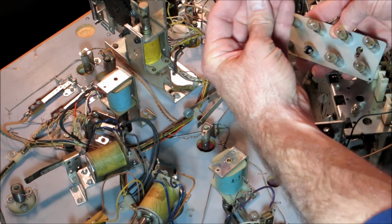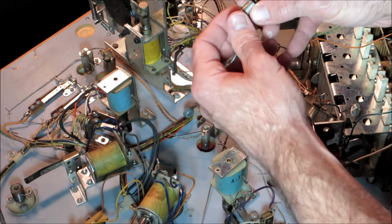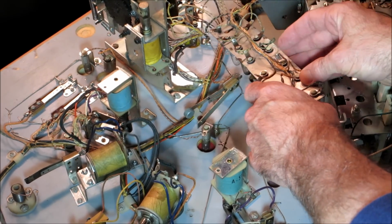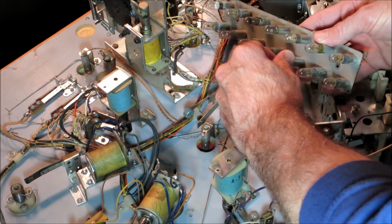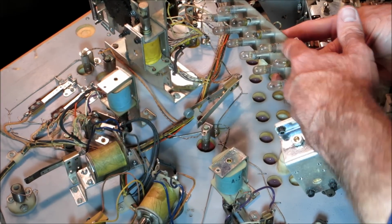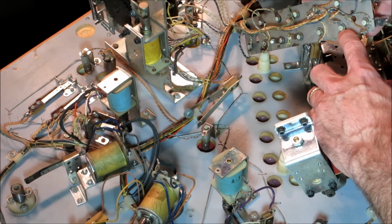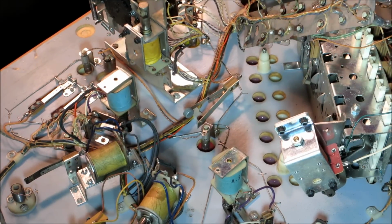So the way the light bulb works is when electricity is applied here and on the outside, it's going to light the bulb. To handle that, the manufacturers press this barrel onto this metal and soldered on connections on the back. Incidentally, what can go wrong here is as those insulators dry up, you can get a bad connection between the barrel and the metal, and you'll get flickering lights or intermittent lights. The other thing that can happen is this mechanical connection between that tip and the spade where they put the wire on. That can have poor connection as well, and I've actually moved the soldered wire from here to the actual tip to avoid that mechanical connection.